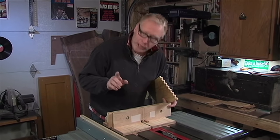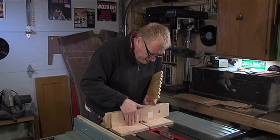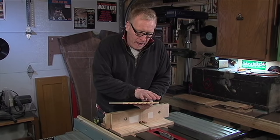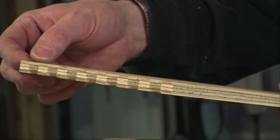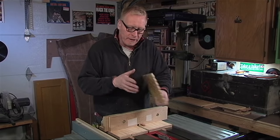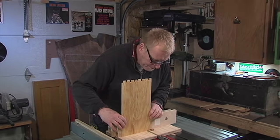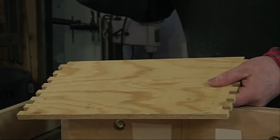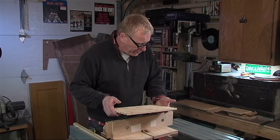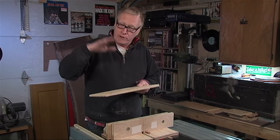Before you make your next cut, just do a little housekeeping — check to make sure there's no debris in there. You want the board registered against the fence and down on the table properly. If you wanted to, you could work it out so the spacing was a true half-inch socket. Sometimes it could be a little less — it doesn't matter though, they're all going to register together. I'm simply going to turn this over and do the same thing on the other side. So easy — don't be intimidated. You don't have to make an elaborate jig like this; you can make a simple one. There are how-tos on the internet and woodworking books. I'll go ahead and do the same thing on my other side and then we'll talk about the top and bottom.